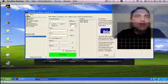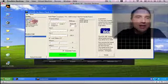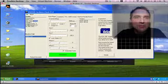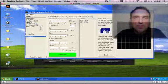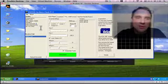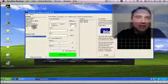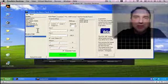So let's see what about the status. This interface is a RGB, that's the name of the interface, RGB laser. It has maximum 50,000 pps, which means 50K. It has maximum 4 color lines, that means RGB plus intensity. Intensity is, for example, just the green or just red lasers. And also it has 512 DMX channels. It has no TTL lines, which are only in the Pro USB and in the network interfaces available.